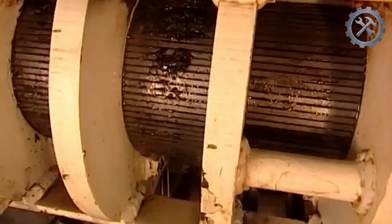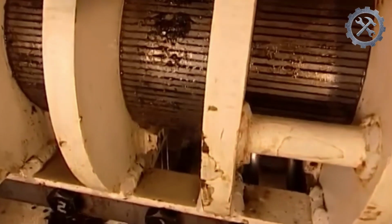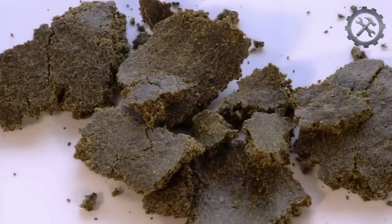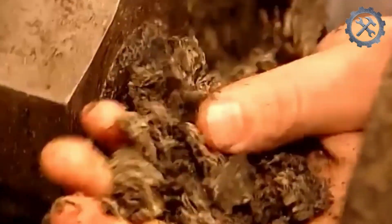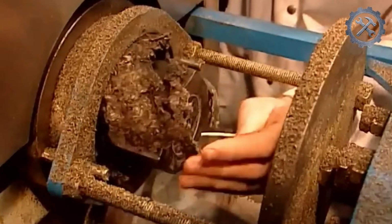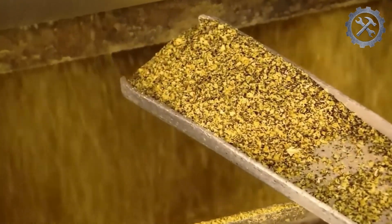This produces much more oil, but it also generates heat that darkens the oil and reduces its aroma and nutritional value. After the mechanical extraction process, what remains is a seed cake. This cake contains crushed kernel remnants and may contain small amounts of residual oil. The seed cake can be used for animal feed production due to its nutritional content.